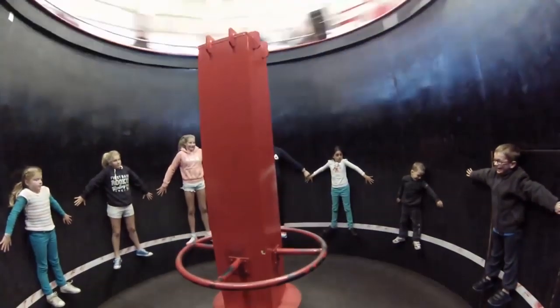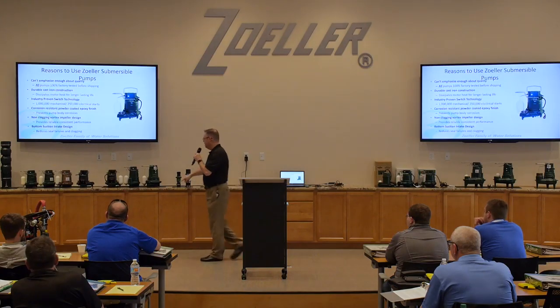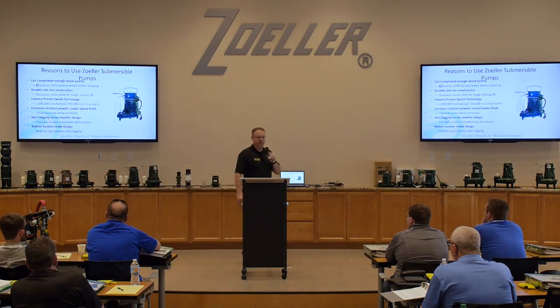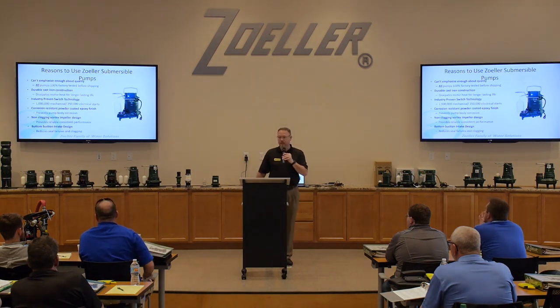I don't remember what they called it, but you stood against the wall and the thing would start to spin and you get sucked to the wall and the floor would drop out, and through centrifugal force you're stuck to the wall. Really the same thing is going on inside that pump with the fluid. It's being drawn in through centrifugal force, it's being sucked to the inside of that wall, and then out through the discharge of the pump. Because of that, vortex impellers are really good at passing solids and not clogging.